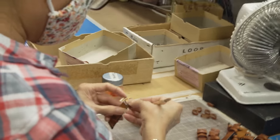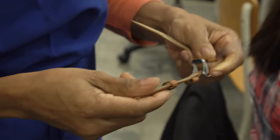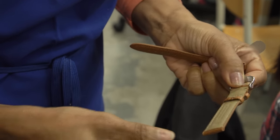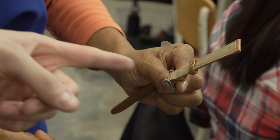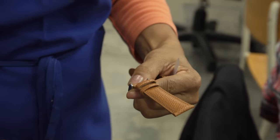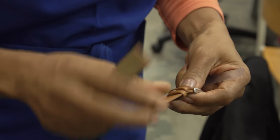This is where I've been telling you about the looping. This is genuine leather — she glues it and puts a loop back in, then glues the loop to hold it in place. She has a floating loop and a fixed loop, puts them on and presses it. After she finishes, it gets marked where we go back and hand stitch it — that top hand stitching is always done by hand. It's inspected and cleaned. Then if it gets a buckle, we put the buckle on. Or if it gets a speed pin, we put a speed pin in — and that's basically it.